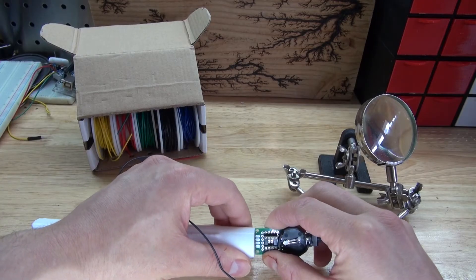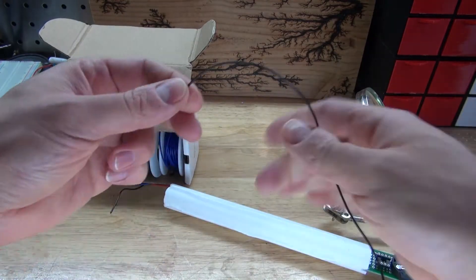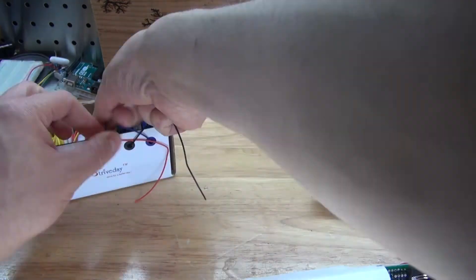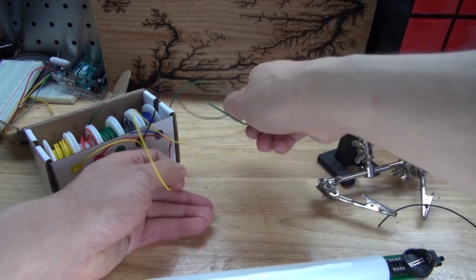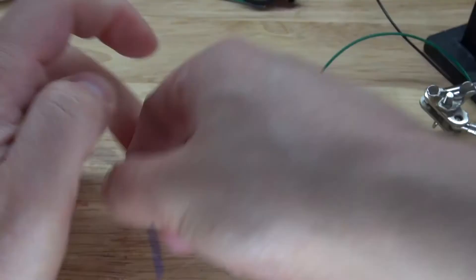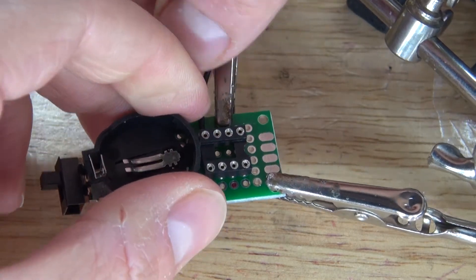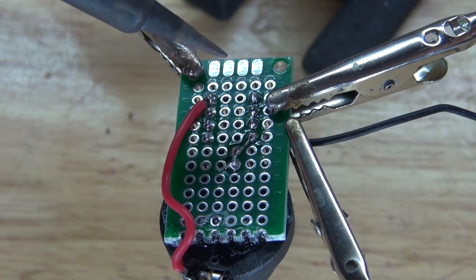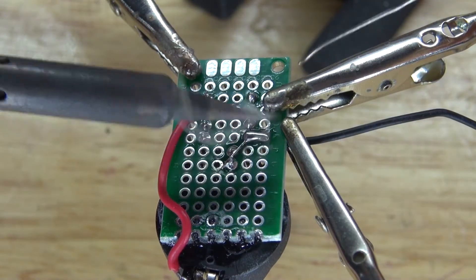Next, what I need to do is wire up the circuit. I'm going to take the perf board and stick it into the notch. I'll take some wires and estimate the length — this is the negative wire, so I need to cut three more wires like that. Now I'm ready to wire up the circuit. First, remove the insulation, then place the negative wire over to pin 4, clamp it down, solder it into place, and solder bridge it to pin 4. The negative wire is now grounded.